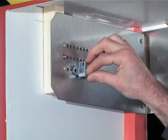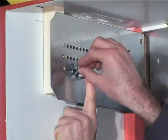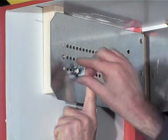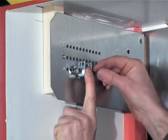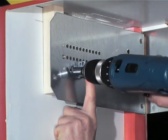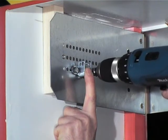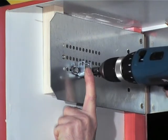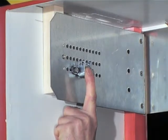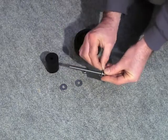In other cases, you have multiple drillings for adjustment. To obtain the horizontal position, do the same with this formula: the distance between the roller supports and the wheel drillings must be greater than or equal to the radius of the rolled-up shutter plus 20mm, plus 40mm for Alu 30 or plus 50mm for Alu 40. Now fix the roller support onto the side panel in its final position.